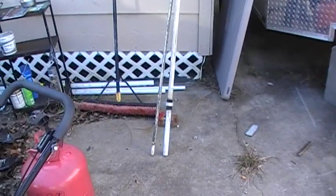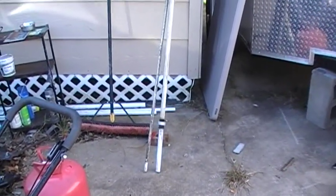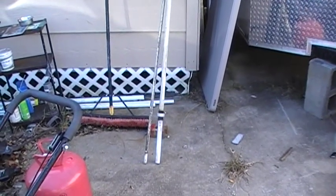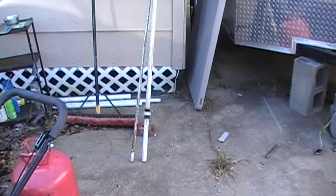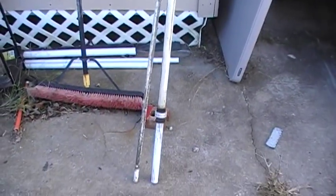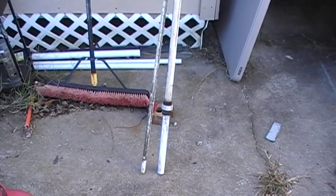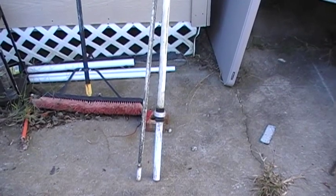Now, with that said, I want to talk about bandwidths. This IMAX is literally twice the bandwidth of that Tornado. I'm not making it up. The only reason I pulled this down was because over time it started failing, and actually the center frequency on it, where I had it tuned, went up to 28.5. It started doing some crazy things. I pulled it down.